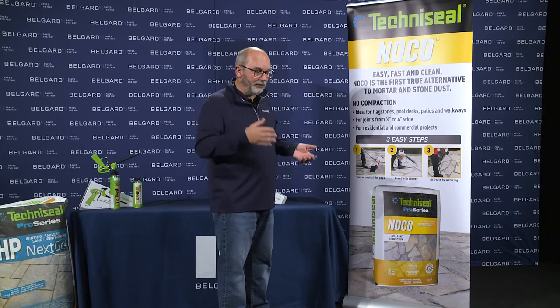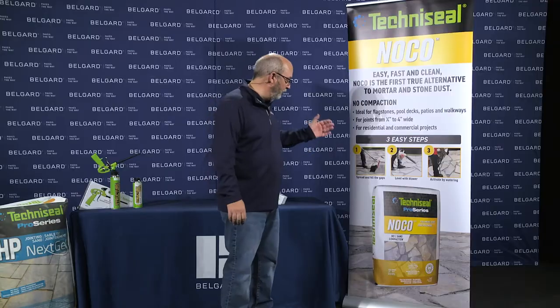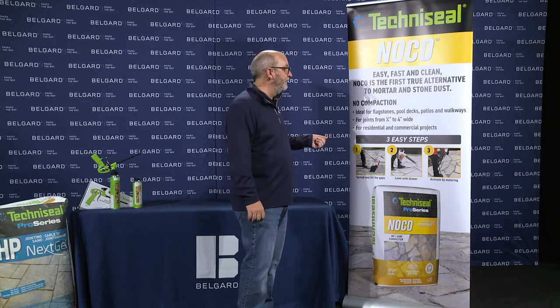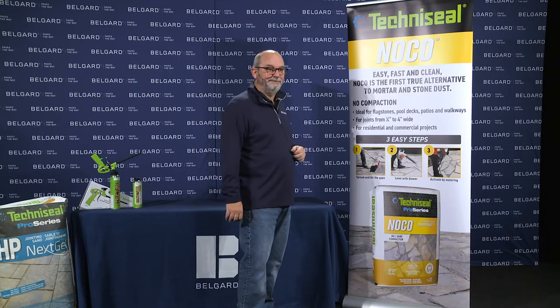Easy to install, typical installation. Pour it on the surface, sweep it into place. Broom it to tidy it up. Use a leaf blower to get your levels. Water it into place. NOCO, 2 colors, available here in Western Canada. Little video to show you how it works.